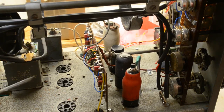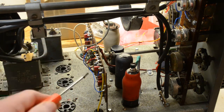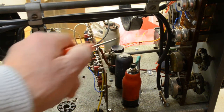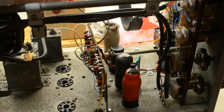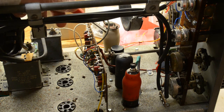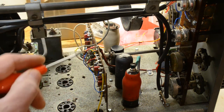Right, in front of you is the time-base board with the time-base capacitors, two sets, and the switch, and the remote shaft going to the front panel. Valve-wise, we now have a VR65, which is at the end here. That's the commercial equivalent of the SP61, of course.